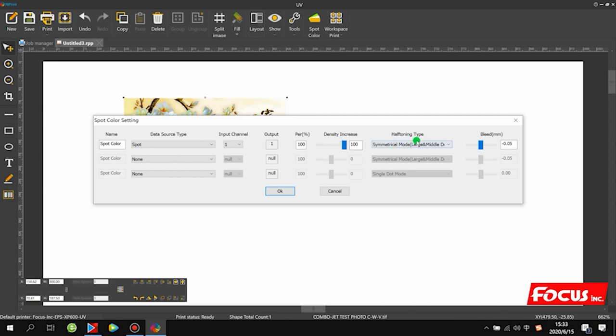And then we can go to the halftoning type. We can choose the large to middle dot, or the symmetrical model, or this one. Normally we choose this one. This one is large, small, middle, equal dot. And then bleeding is for anti-overlap. So normally we use minus, not plus, to make the white ink edge smaller than the color layer. Then the white ink will not print overlapping. So normally we just set it at 0.01